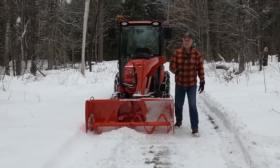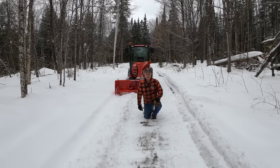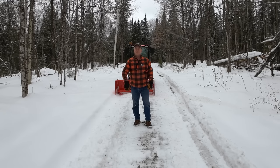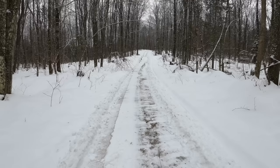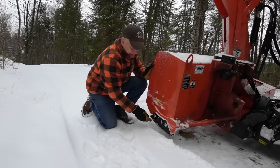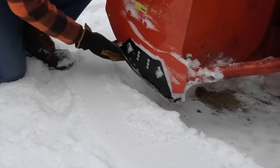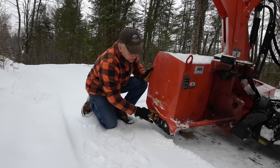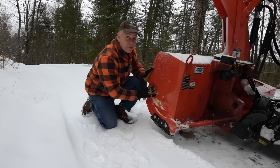It doesn't take long to realize this driveway is still not frozen. In fact, it's trying to freeze, which is why the cutting bar on my blower keeps running into big boulders. I'm not sure if you can see it in the video, but it keeps stuttering and you keep hearing this bang — that's because I keep hitting boulders all the way down the driveway. These skid shoes are not just for looks. This is what your blower box rides on. Whatever the hardest part of the driveway is will run under these shoes. If you've got a gravel driveway, I learned early on that you want to start your season with these shoes lowered as much as possible — in other words, your box is as high up off the ground as possible. That minimizes how many boulders you're picking up.